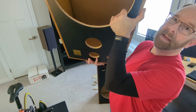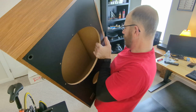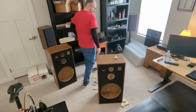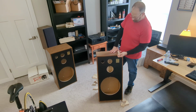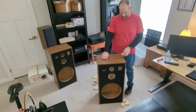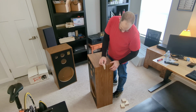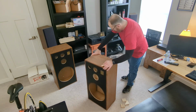Yeah, so the inside of this guy, if you could see down inside of there, it doesn't have really good strength up at the top. So in the top, what I'm probably going to do is maybe throw a couple of these guys up in here, possibly up inside in the corners like this. This piece is already pretty rigid here. By adding these in there, I'll tighten it up even more, and it'll transfer that same strength into this area that's still resonating.